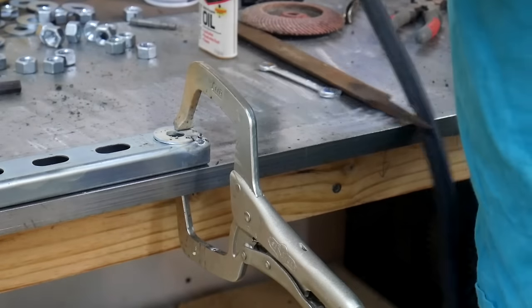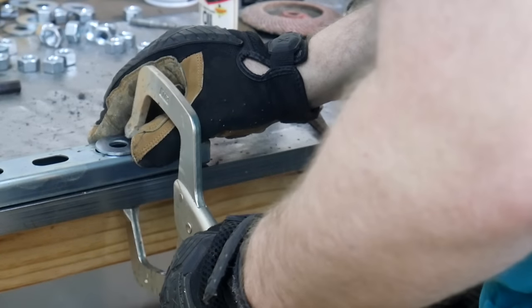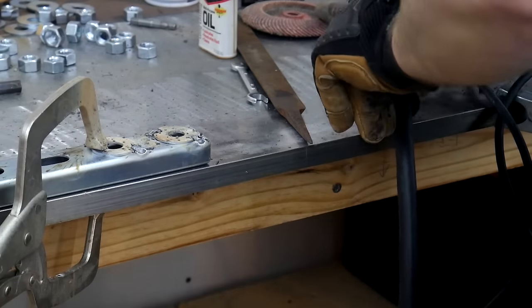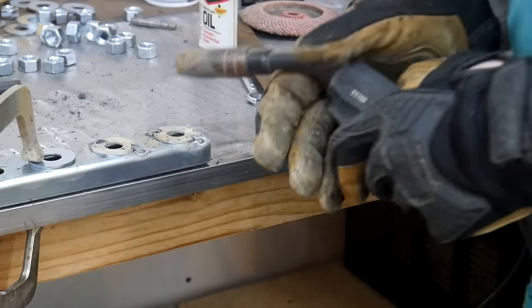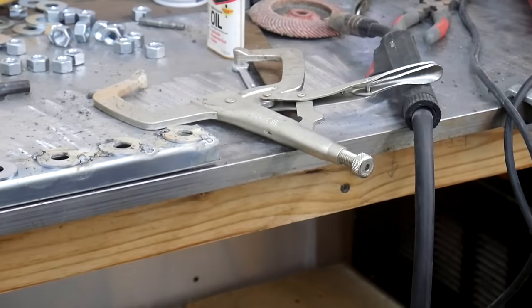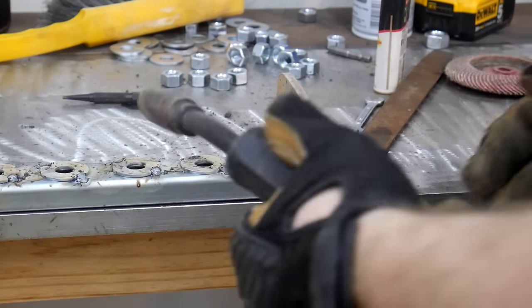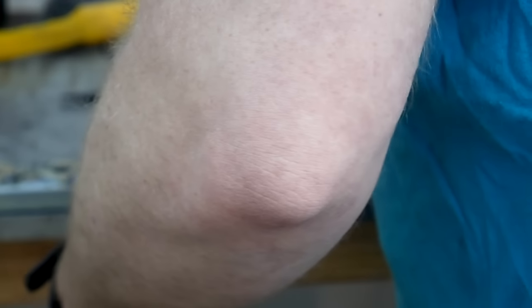Now that that's out of the way, I begin welding on the Unistrut by adding washers to all of the holes that I'm going to use. The reason I use washers is just to spread out the load a little bit. Since these half-inch nuts don't have a lot of surface area, they're going to tend to bend or kink the webbing of the Unistrut, and so the washers help spread out the load. After the washers are attached, I attach the nuts to the washers. I'm using nothing but tack welds here because all I want to do is hold this stuff in place — it doesn't have to carry the load. The welds are just holding the washers and nuts in place so I don't have to use two wrenches when tightening these bolts down when I'm using these clamps.